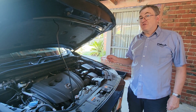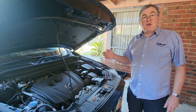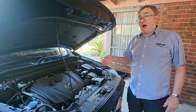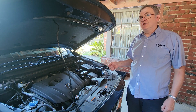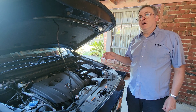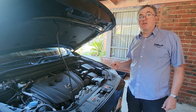This engine will have a mixture of glycol and water in its coolant system. The glycol will increase the temperature of the boiling point while also lowering the freezing point. When it comes to comparing to our model engine, it's the boiling point — increasing that boiling point will be of value for us. So we'll be using a similar mixture in our coolant system.